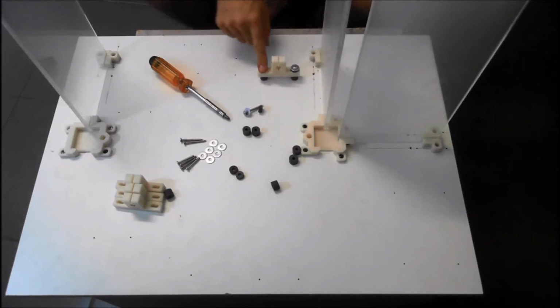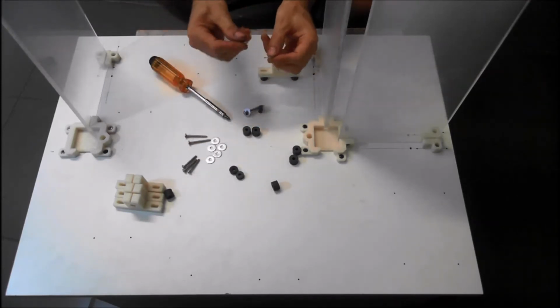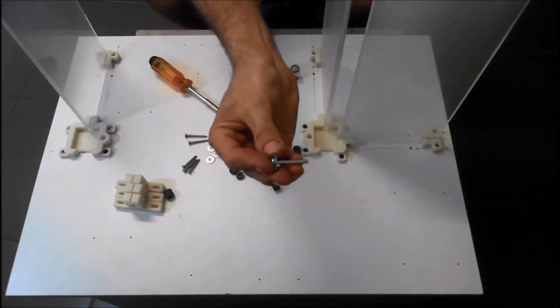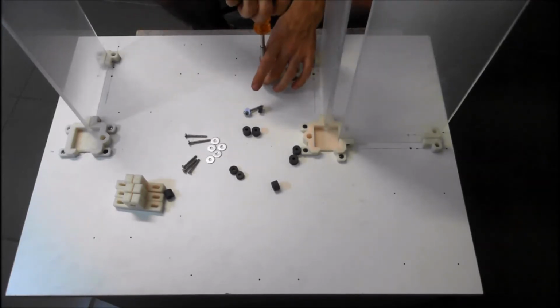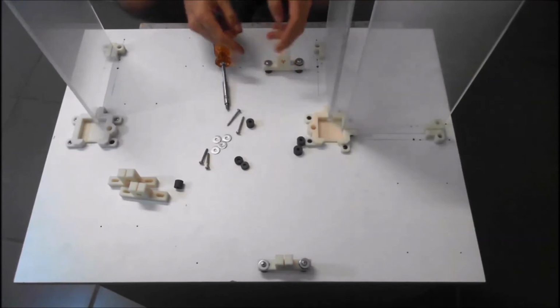This inner screw actually needs to be one of the short ones, and we don't put a rubber washer on there because the part of the bed hits it. So for the inner holes, we just use a screw, the shorter screw, about 30 mils, a washer, and then straight through into the base, and then the large bush underneath. Okay, so we've just finished screwing this one down.